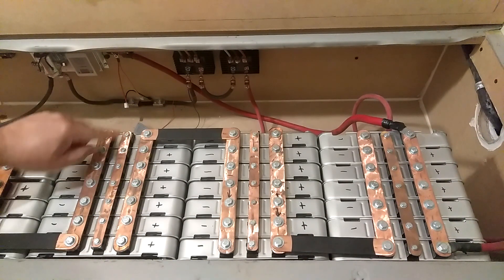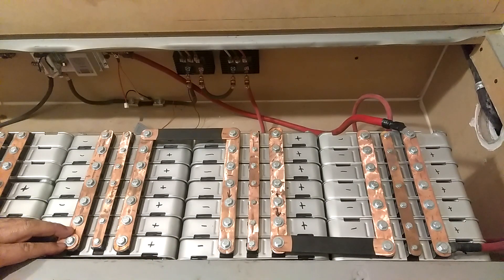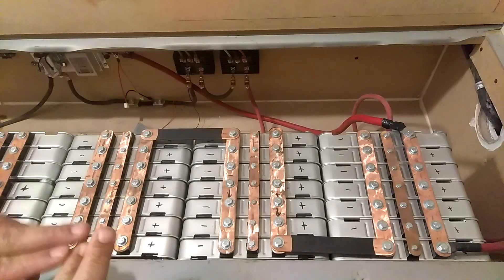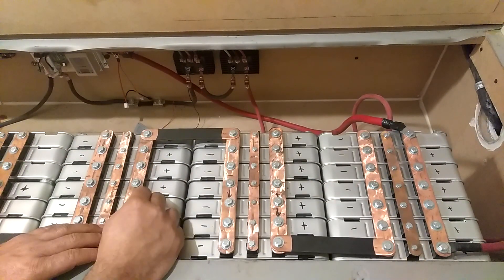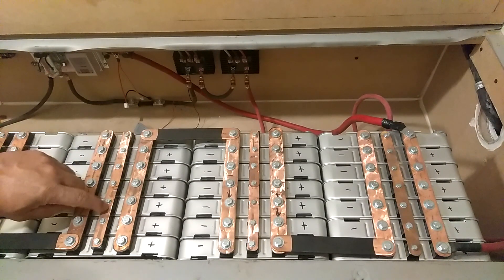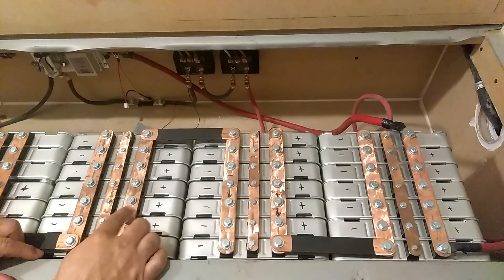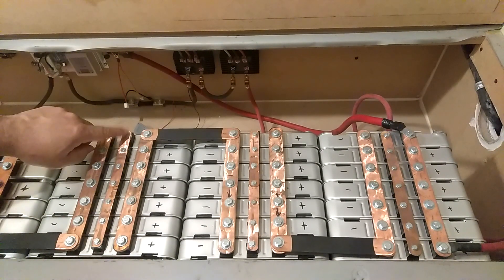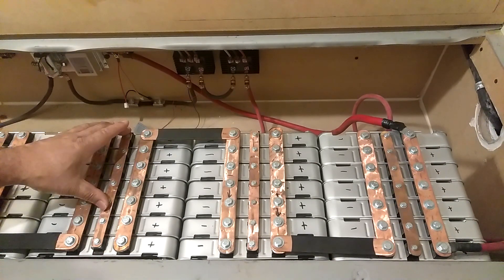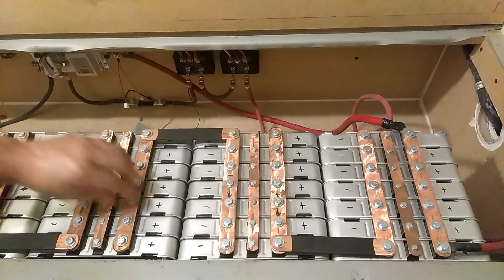Now I put these taps in because in a Nissan Leaf battery module it's actually 4 different cells inside. You've got 2 batteries in parallel, then 2 more in parallel, then they series together to 2. Basically what I've done here, but instead of 3, it's 4 inside. So you will have negative, positive, and then it's backwards — positive, negative, and then positive. The reason I put this down here is it helps the battery stay equalized when you tie them all together.